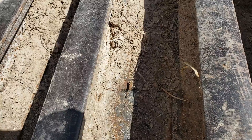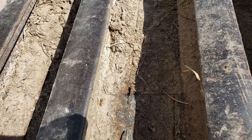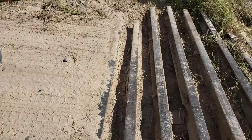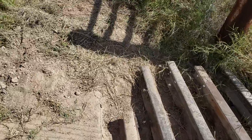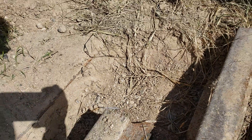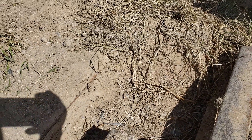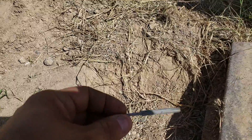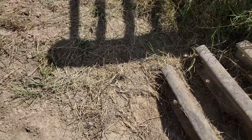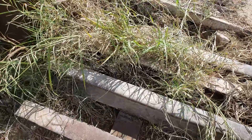On this one you can see they added some maybe quarter-inch solid bar in there, and I think they added a bolt on this other end just to kind of give some reinforcement. But they didn't clean anything down here to get good penetration, and these are E7018 electrodes.